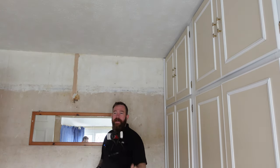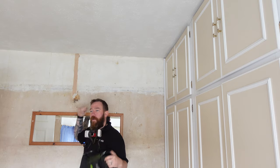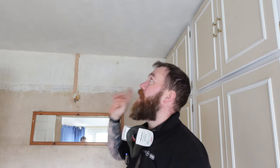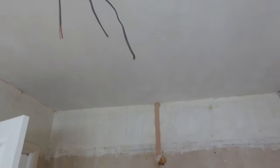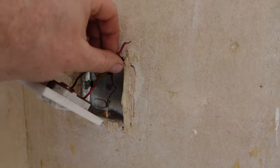I've disconnected the lights. James, if you give the cables a pull when I'm up there I'll know where they are. I'm going to pull the three lights back, find out where the original joint was, then come down, mark up the center of the ceiling, drill a hole, get some cable up, and get a light on the end. We've managed to get the original cables back down — loop in, loop out, and the switch wire I've stripped while I was up there so we know which is which. There were a couple of JBs up there — I got rid of all that.